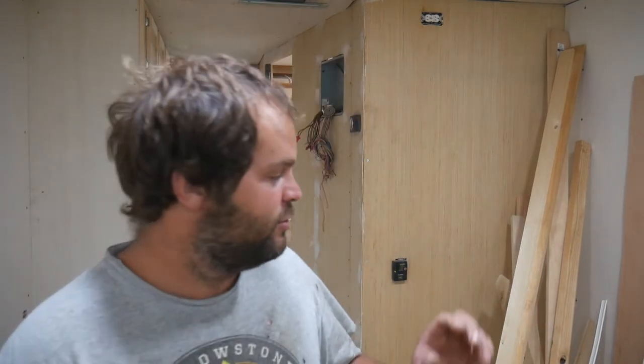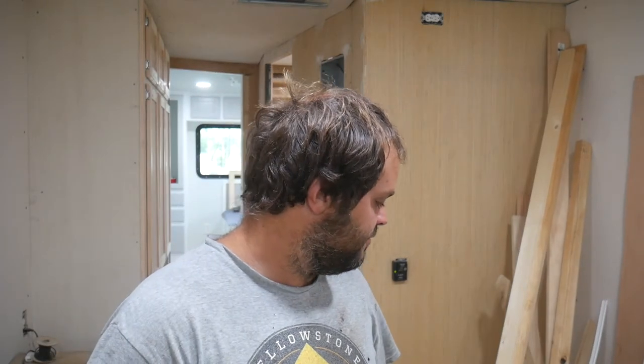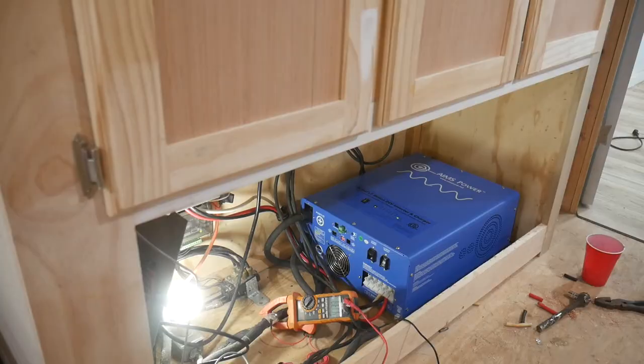I'm gonna try to flip from shore power to inverter power to see if that inverter can react fast enough to take on a very large load, probably 7,500 watts or more. And then I can turn the water heater on and, I don't know, I might find some electric heaters or something to plug in to put more load than that on it. So I've got a breaker right down here I can trip. When I trip it, it'll trip the contactor back to the inverter side. And let's see what happens. Here we go.